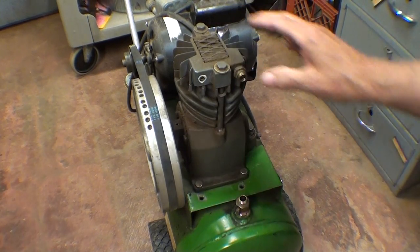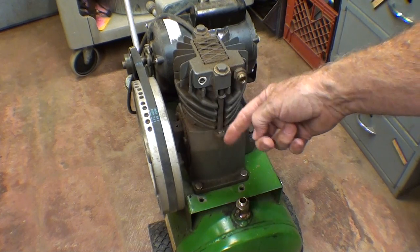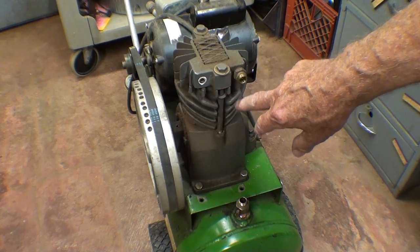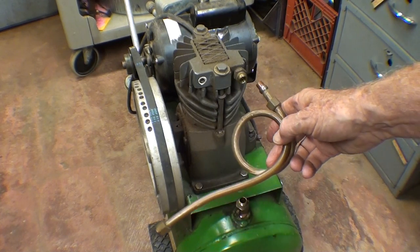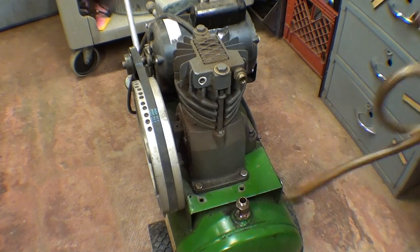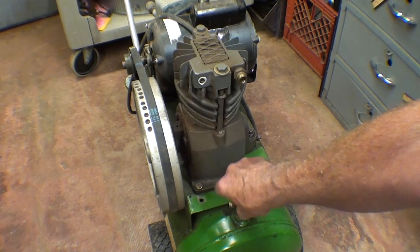When I bought this compressor 38 years ago, there was a plastic line of some kind, and it would get so hot up here that it melted to some extent and it would leak. So I replaced it with copper. I mentioned that before. So cheap quality is nothing that is brand new. They've been doing it for a long time, and I got this fitting out.